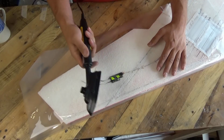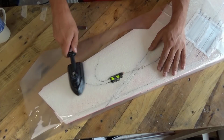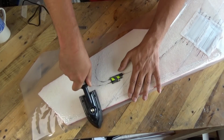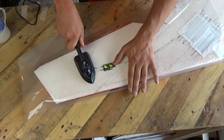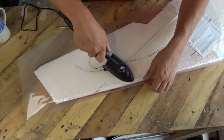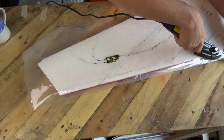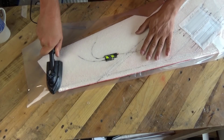Okay, and go careful, if you've left this iron on the side for 10 minutes, it's going to be corking hot. So just be aware of that. It may start off fine, but the more and more you use it, you may notice, like I just did a few moments ago, that it was losing its tack. Okay, so we're making a pretty good job here. So I am just going to run it up to that leading edge, but not over. I'm trying not to melt the glue on the very front edge. There we go. Right, brilliant.